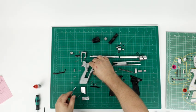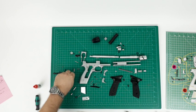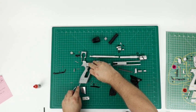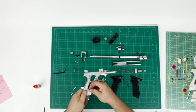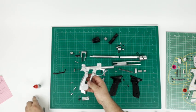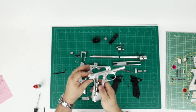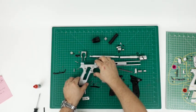Got that in there. Now we need to put some tension on that spring, and that's done with one of these dowels and part number 36. Get your screwdriver — just a little flat blade. From the bottom of that hole, go up in here and push on the spring right beside the strut to give it some tension. See how it's pushed this up? Drop this in there. What that did was capture the spring and stop it. You can push pretty hard and get a lot of tension — that's just personal preference. I just do enough to make it function.